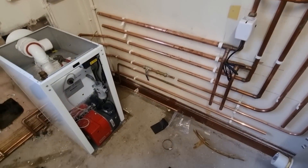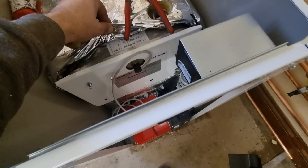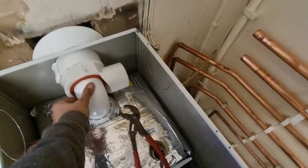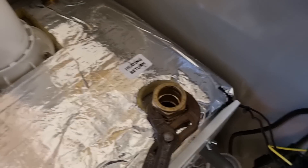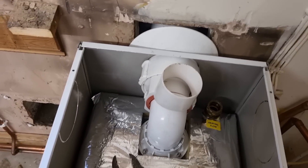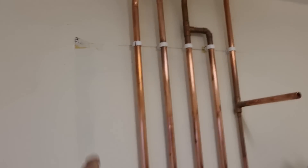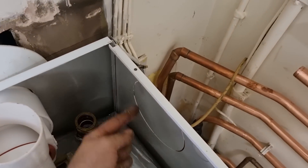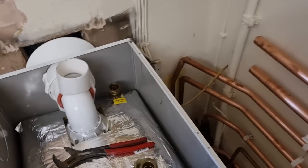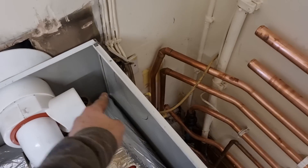The unit looks nice — very similar to other boilers on the market. We'll have to see how it lasts, but it doesn't look rubbish; the connections are nice and easy to get to. I'm going to use these knockouts here — possibly that one for the return and put the filter there. All our pipework is going to rise up so we can bleed it through the upstairs rads — no auto air vent needed. It's nice that you can spin the burner out of the way, do all your connections, then connect the hose on last.